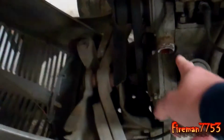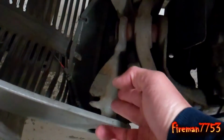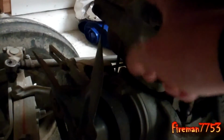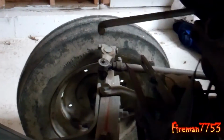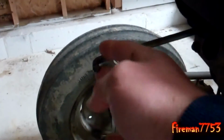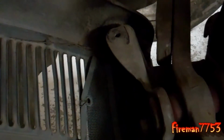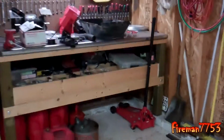Okay, just take your hose clamps loose. Here's your water pump. Take the clamp loose on there, and it goes to the lower port on the radiator, I'll show you when I get it back together. Pull that off. Your intake up here, that's a little short hose, take the clamp loose there, and then you got this little bar that goes to the back side of the top of the radiator. You pull out a little cotter pin in there, get that out of the way, and then there's 2 bolts that you take loose, and then it just lifts right up out of there.